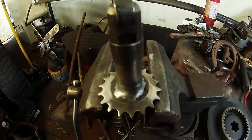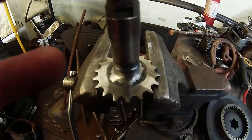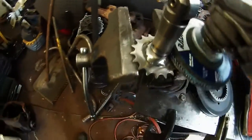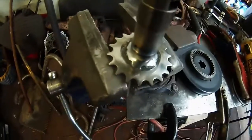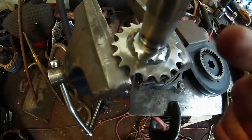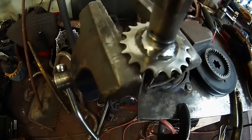Okay YouTube, I think I'm having a bad luck day. That washer was actually a galvanized coated washer — as soon as I started turning up the heat it started throwing those little spiderweb things floating in the air, giving me really ugly welds. I came up with a fix: since this is technically kind of an art thing, I started taking my flap wheel around to clean up the ugly welds. I'm gonna switch to flux core, flip it upside down, weld the hell out of it from underneath, and just fill the whole thing with weld.